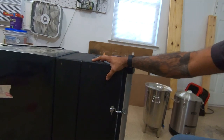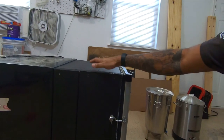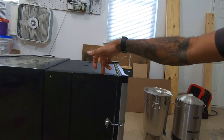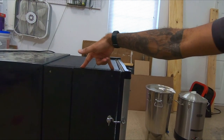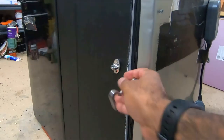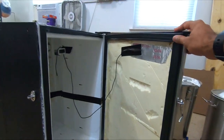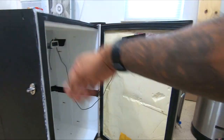If you flip it that way it's the same concept as doing a keezer bar, but just using 2x6s and 2x10s to give me the distance offset I needed to fit two fermenters in here. I use a latch to lock the door because the door is magnetic off a regular fridge so it's not going to stick to wood.